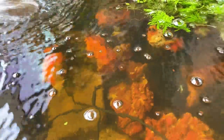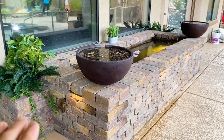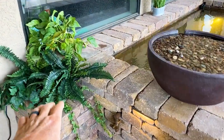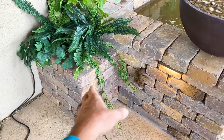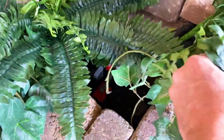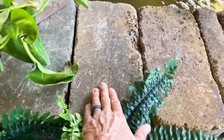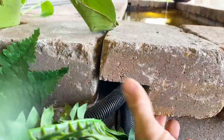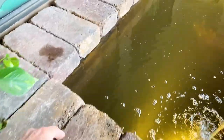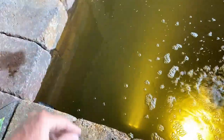As soon as that pond clears up and the water acclimates a little bit, these little beauties are going to be relocated. Some of the bells and whistles on this pond — we have the homeowner's old filtration system installed right into these little wing wall bump outs. What's in there is just an external pressure filter setup, and the plumbing goes right through. This block is not glued down, and that plumbing passes right through there. Nice and clean. We have the intake and the discharge mounted right down inside there, so it's providing circulation.